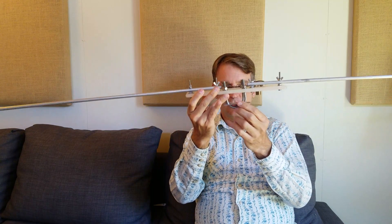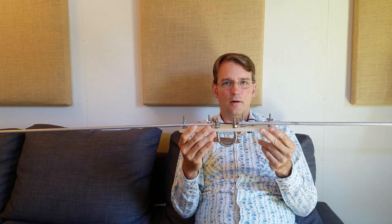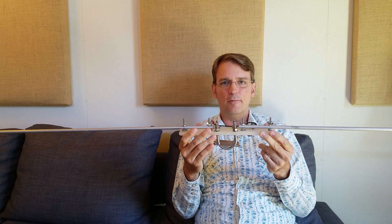In order to do that, we need to hear from you. So go spend a little bit of money on this little setup right here — you can make your own rigid dipole antenna, clamp it to a pole, put it up just a few meters, and you're good to go. Listen on 50.125, 50.130, 50.135 — second weekend in June.